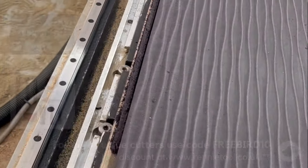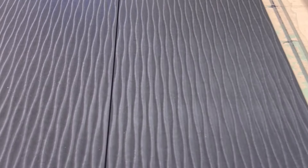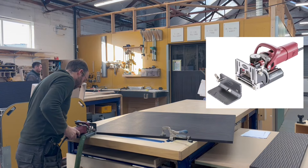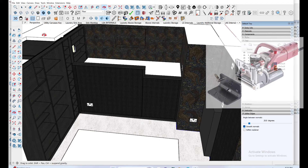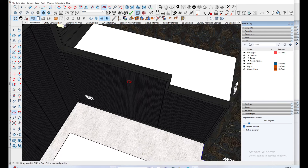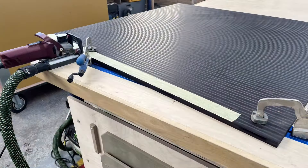When using a compression cutter it can leave a compressed slug of dust in the gap after you've removed the outer waste frame. With the boards moved closer together you can see how the final 3mm door gap still leaves the pattern running through. Here you'll see me using the Lamello Zeta P2 handheld machine — without the fence, just using the 10mm reference off the base — to cut the P-system slots. This was for the bed panel which had the effect of wrapping around that textured wall across the front of the bed. The P-system fixings, both Clamex and Tenso, were used to line up those panels because they went beyond the width of the board.